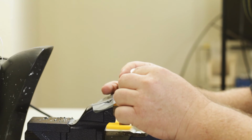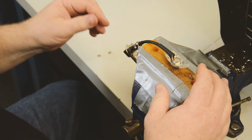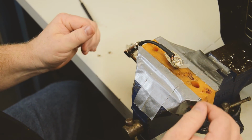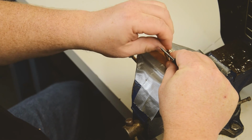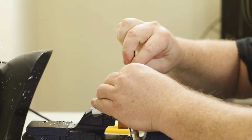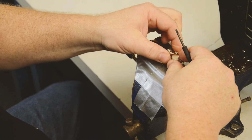So now we want to put the cap of the 229 plug on. The 229 plugs come with a couple of small flathead screws, so you'll need a small flathead screwdriver in order to affix the top. So we'll go ahead, make sure that the Mylar protector's down. I like to start the first side and then get the second side started.